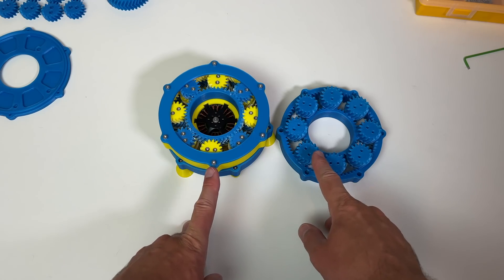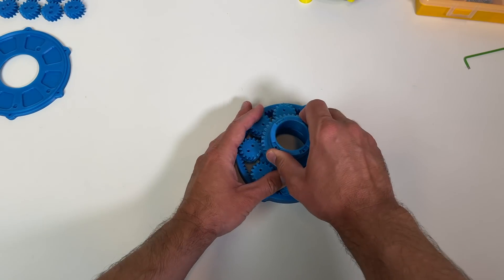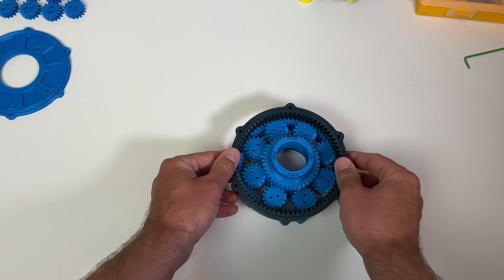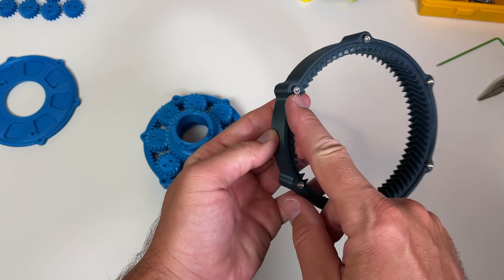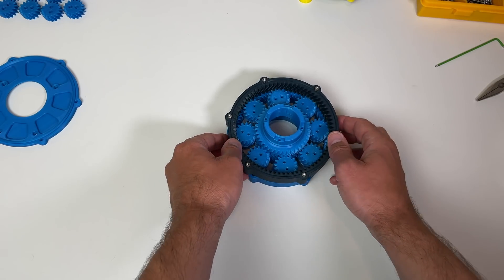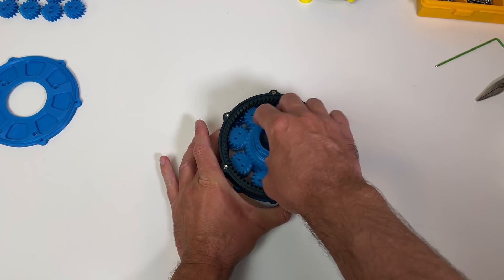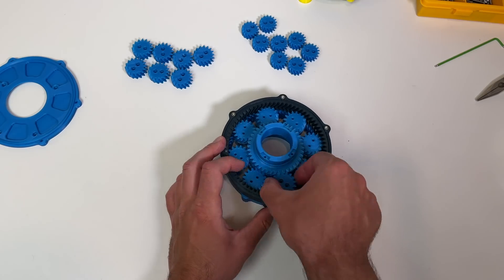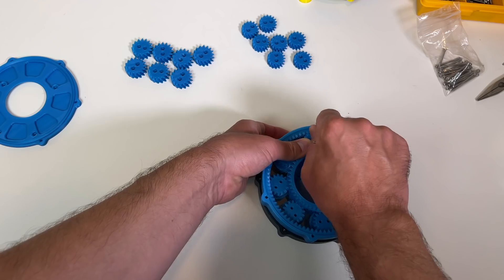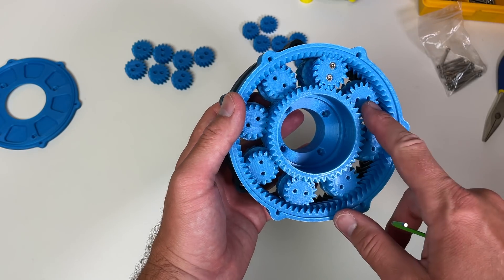The orientation of the planets is the same here and here. Another sun gear goes in the middle, and I should not forget to put the embedded nuts in here — and the same on this ring gear which will go here. On the other side of the ring gear I installed the screws. These embedded nuts are not going to fall. Now the ring gear goes on top. We can continue to assemble the planets, and 40-millimeter screws are going to hold our planets together as one happy piece. I need to repeat this procedure with the other seven planets.